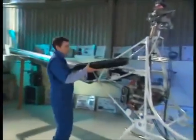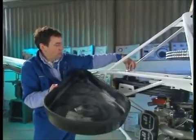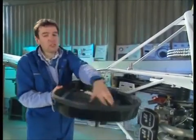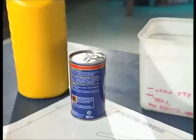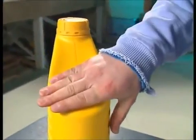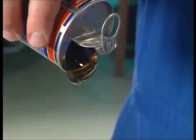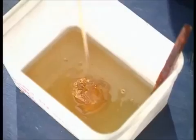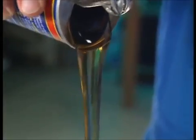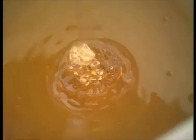Over here is where the oil bath will go. This main tooth cog will sit in there, and the other one that sits on top at the other end of the chain will be inside here. It is to bathe and lubricate the chain — it's got to contain oil, but no ordinary oil. It's a mixture of good high quality engine oil mixed with this very gloopy stuff that is very like treacle, almost good enough to have on your porridge in the morning. That thickens it up nicely. One of the jobs first thing in the morning when you've got the helicopter complete is you tip the helicopter back a little bit so all the oil in the bath runs back down to coat the small cog, and that will get all the oil on the chain so when you start running up you've got the whole thing lubricated.